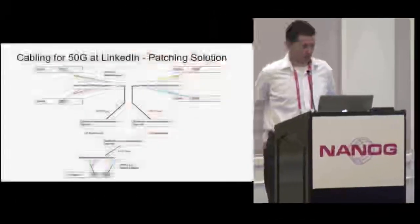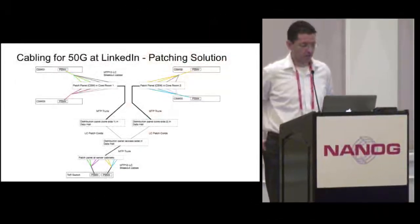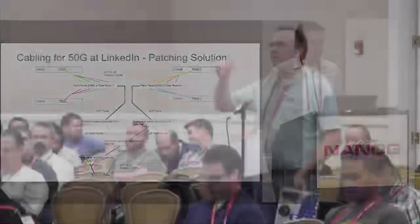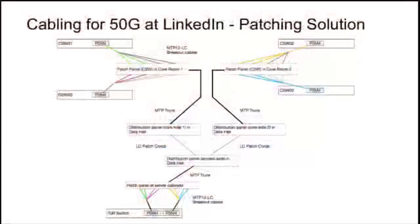So that was done in the cabling infrastructure itself. Here you can't do it twice, right? Otherwise you're going to end up with a straight side. We did it on just one of those MTP trunks, and then as you hold it back to your distribution, you're dealing with it there as well. So the breakouts are effectively straight, but from within all those pairs, you just need to flip once. And so that's done within the MTP trunk.